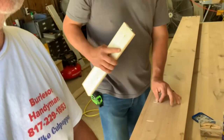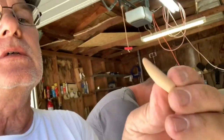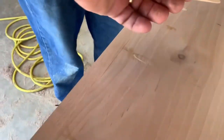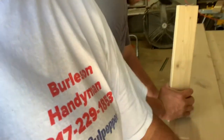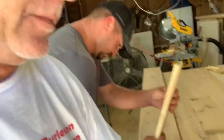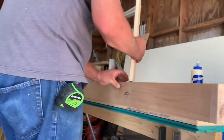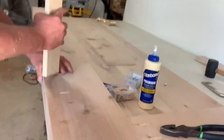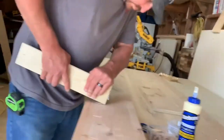Now we're down to plug our holes. We've got these little wooden plugs — just go in there with a little dab of glue. Once you get them in there, sand them off. These are paint-grade but I think they'll stain okay. This is the bottom side, this is the wrap-around. Next thing I'm going to do is get the router out and route this edge while I've got it upside down.